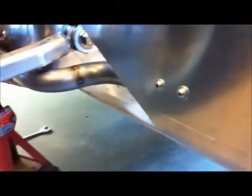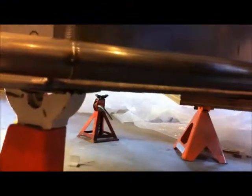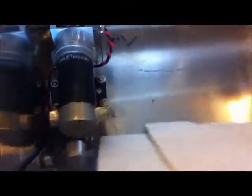Just a note here, don't roll up too soon. The reason why we rolled up on the inside instead of the outside here was the clearance under the A-arm. It's only maybe 5/16 of an inch. So you've got to hug the pipe along that lower profile of the car. Basically, 1/8 to 1/4. You've got to follow that line right around. So you're going to have that clearance under that A-arm. Right now, because there's no weight on that car, that's as low as that arm should go. So that's the reason for having to cut that profile in on the inside and roll up.